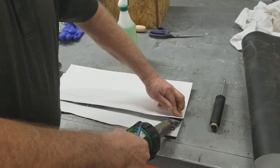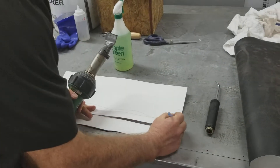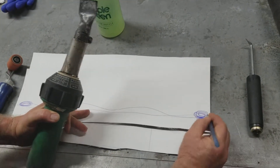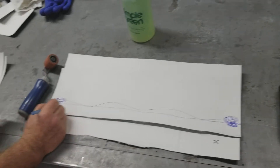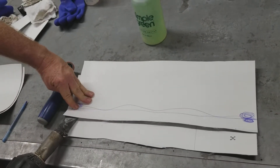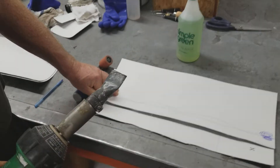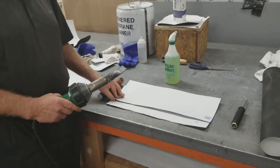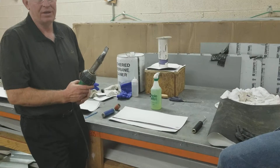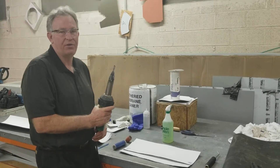Tacks need to be included inside your weld area. So if you're going to have a tack, it's got to be inside your weld area right here. I'm going to weld this, so I have a tack here, and I want to have a tack over here, so my tack could be moved in a little bit. But what does that do? It shrinks the area of our weld. So what happens when you heat a smaller area — it heats up faster — so you have to move your heat gun potentially a little bit faster in those small areas.